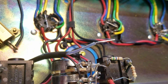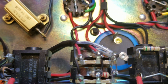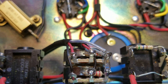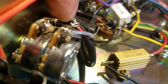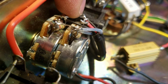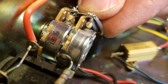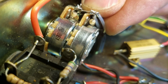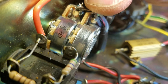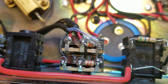Back to the pot: there's the first lead, there's the second lead, and there's a little tin on that shielded wire lead to make it go through the lug a little easier. There's the third lead — those shields are soldered in now. Before I secure this pot to the chassis, I want to show you how close that shield is to the pot casing — that's why we insulate those. If that moves around or turns loose and the shield contacts the casing, it will ground out your bias supply and you'll blow the tubes. That's why it's important to insulate those.